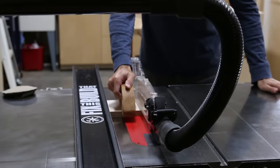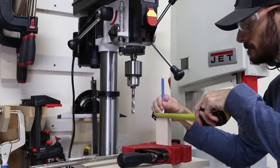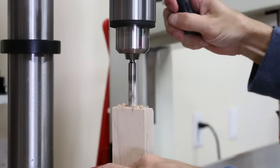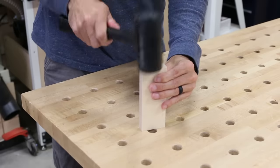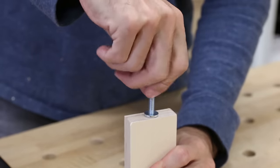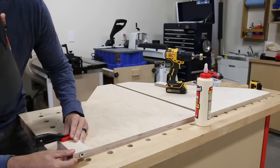The triangles attach to the cabinet and small risers extend up to support the side wings. I cut a couple of small blocks on my table saw and drilled holes down the middle of them for adjustment screws. You can do this with a hand drill too — just try to be as straight as possible. The holes are for threaded inserts that you hammer into the top. This lets you install a quarter-20 bolt that will hold the side wings, and the threads allow for adjustment up and down so you can get the wings perfectly level.